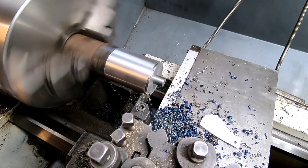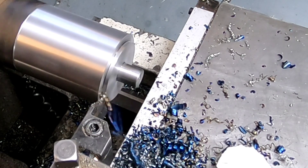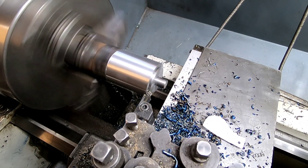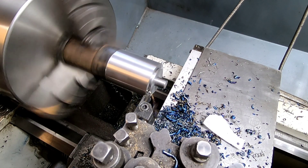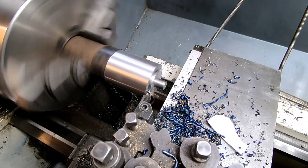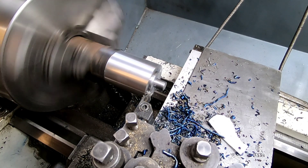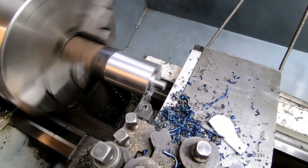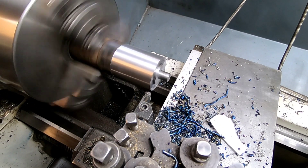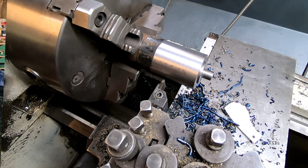We're going to go in one inch. You can actually see on the side it's cutting so precisely that it's got a tiny little lip — that lip is just folding over and getting pushed off to the side; it's cutting right on the money. I'm actually changing the blueprints yet again, but I'll have the finished blueprints at the end. The reason for the change is because the level of paint in the tray — I can tell that little wheel in there would have been dipping into it and it wouldn't work as well as I'd like. Let's move this over to the other side and start cutting the other pin and wheel.